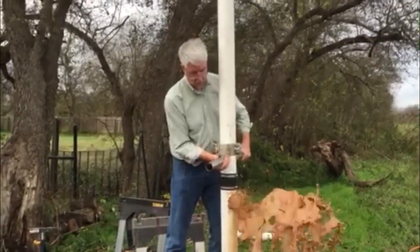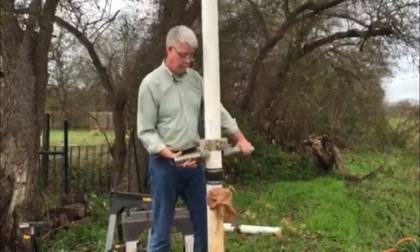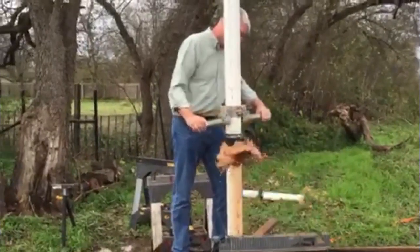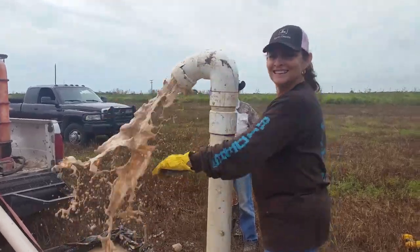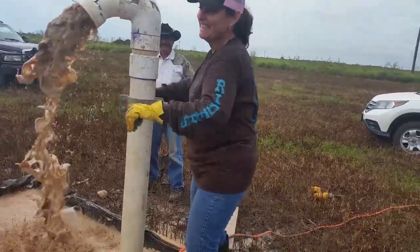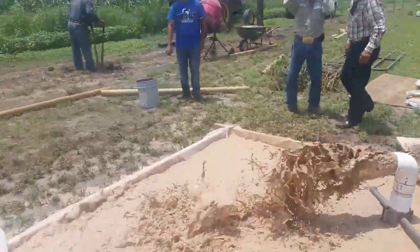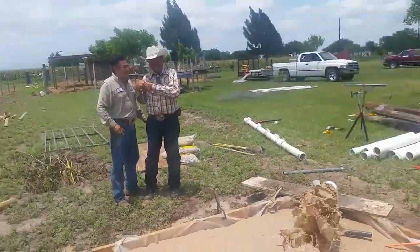This short section will be used later in the drilling process. During the drilling process, one will first drill with the plugged drill stem to full depth. Then the seventh port is uncovered and drilled down. The plug in the top of the stem can then be removed and replaced with a fabricated discharge elbow that directs the cuttings into the mud pit. Once that section is drilled all the way, the 53-inch stem is added and the elbow is attached to the top of that stem. When that section is drilled full depth, the whole starter section is removed from the borehole and 20 feet of drill stem with a bit and elbow is introduced into the borehole to continue drilling.